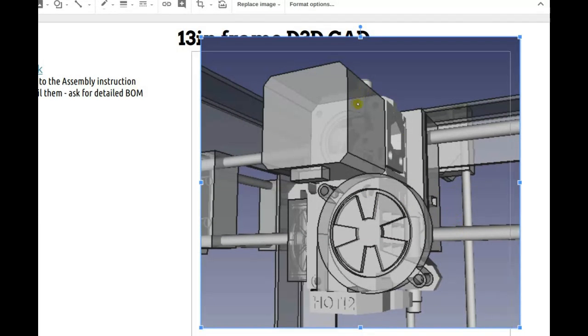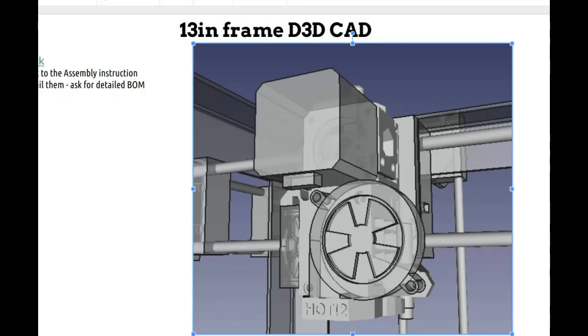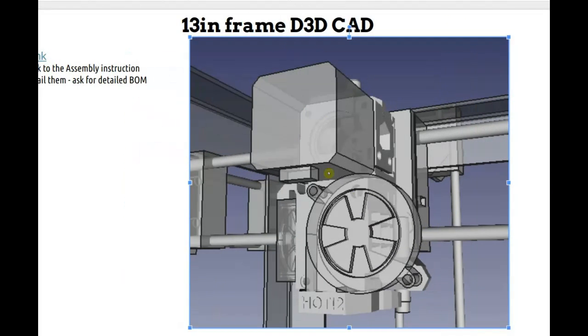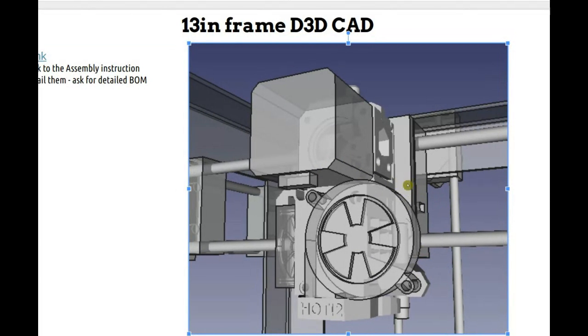What we're doing here is going to the Prusa because we just want a better extruder that we're in control of. The ones we have right now come with all kinds of slight differences when you get them off the shelf. So here, all we need to do is get the hardware, which is the same, and the motor, and everything else is printed so that our extruders are going to be exact.